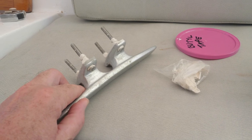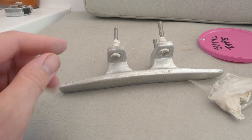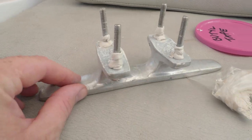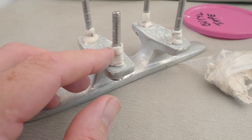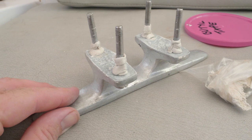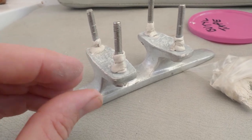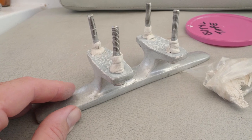The idea — as you can see quite obviously from here — is to wrap Butyl Tape around the head of the bolt, thread it through the fitting hole, and then wrap plenty more Butyl Tape around the base and some way down the actual body of the bolt. When you put this in place and tighten the nut, it will start to squeeze the Butyl Tape and fill both the hole and also the gasket that we made with the countersinker.